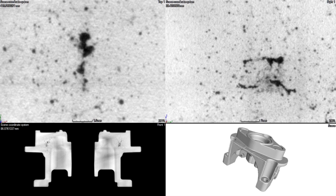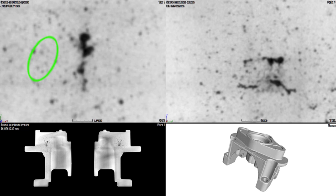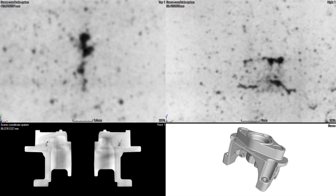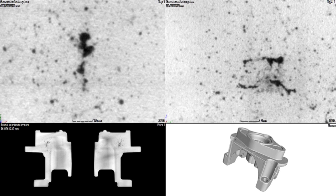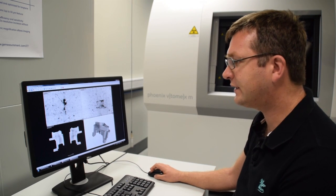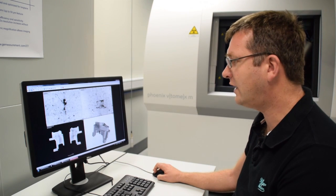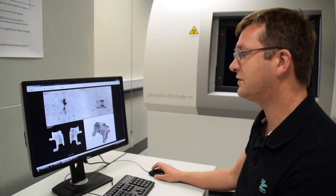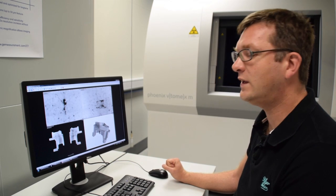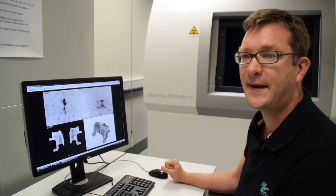Now switching to the Dynamic 41 data, you can immediately see the advantage — higher resolution and the ability to detect much finer pores. For instance, in this area you can see pores that are barely visible with the 200 micron detector. The sharpness of the larger shrinkage features is also much higher. The image looks clean with low noise, and if you compare with the 200 micron detector, you don't really see a big difference in noise — so we increase resolution without major impact on scan time.